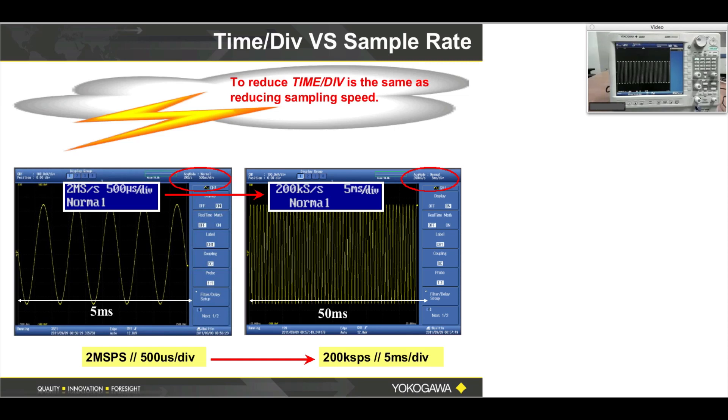I'm going to show you two things that will affect your sample rate. There is no knob on the DL-850 that adjusts the sample rate directly. There is a knob called time per division, but it does not say sample rate. However, this time per division knob does in fact affect your sample rate. Watch my finger as I adjust it left one click, then right — I'm increasing then decreasing time per division. Watch your sample rate at the top right of the screen change when you adjust time per division.